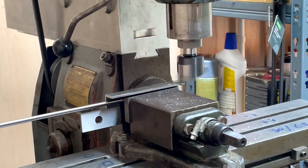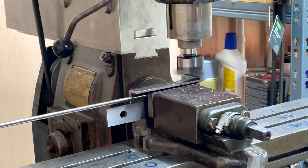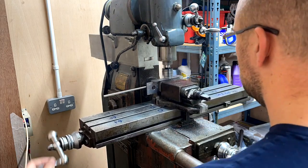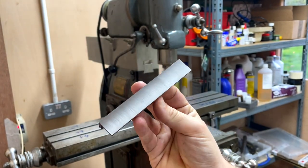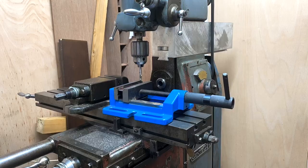If you've watched my previous video you'll notice I had some mistakes — I think I've managed to sort those out. I wanted to give fly cutting another shot because the first time around I don't think I really gave it a fair chance, and I've been really pleased this time. I used it to square up the outside faces of the angle in this buffer beam. The finish was actually quite nice — you can see some striations there but they're basically undetectable by my thumbnail, so they must be sub-thou thickness.